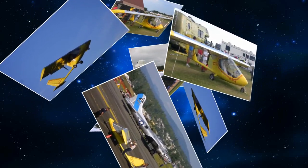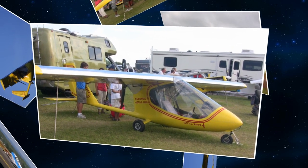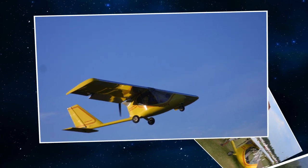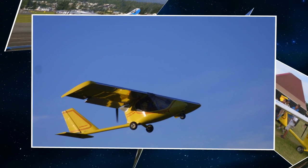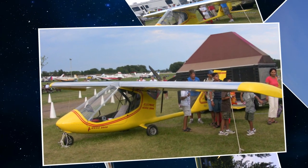Do you think you have the battery technology available right now? Yes. The battery technology I'm using in my plane right now is four or five-year-old technology. There's a new battery system by EIG, and the chemistry is lithium, polymer, nickel, manganese, cobalt. It's the same battery system that Dale Kramer is using in his Lazair and he's having really good success with it. It's a very robust battery, it lasts a long time. He's got five gallons worth of batteries and is getting an hour and a half of flying time out of it.